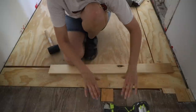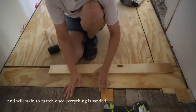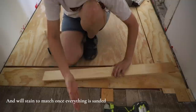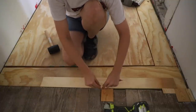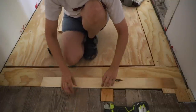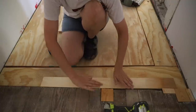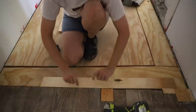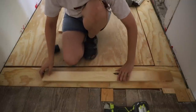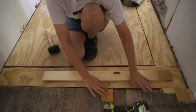So this is one area in the hallway that I've had to patch quite a bit. I just had to. So now the floor, instead of running this way, will run that way. And then we'll put a transition piece here because a lot of these boards are not really cut exactly to size. And this is where the concrete meets. I think it's just better to have a clean little transition piece on top. So I got these smaller pieces in and then we'll wood putty them.